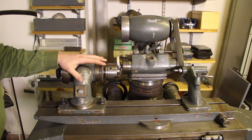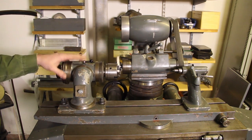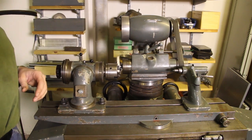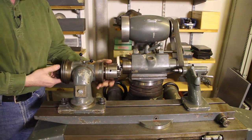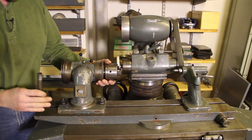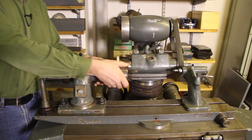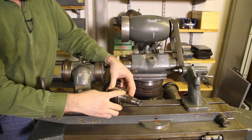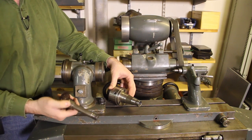Here you can see the main headstock that bolts onto here with those 12mm T-slots. Of course if you have a headstock, you have a tailstock — it looks like this. This headstock has a 40 taper and the accessories can be removed by removing the drawbar. These original Tone accessories have the 40 taper and then they have their own thread for their own drawbar.